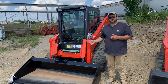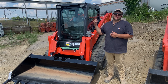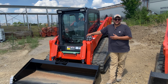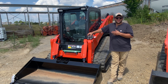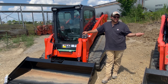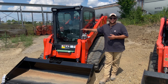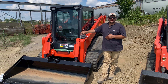The 97 is the biggest track loader that Kubota makes, and it's a very capable machine. It weighs about 12,000 pounds on the high flow machine. It is 40 gallons per minute on high flow and 29 gallons per minute on the low flow. You can run multiple different implements off of this. This is when you start getting into mulchers and power rigs and stuff like that. Not that you can't do that on the 75, it's just going to be a little bit lighter duty — you're not going to be as productive as the 97 because it's got a bigger stance, more flow, more weight, more breakout force. This is a machine that is going to get just about any job you need done.